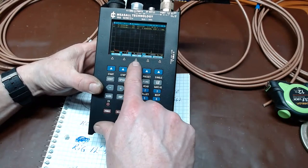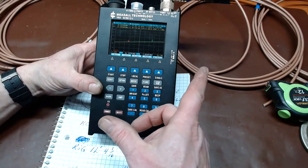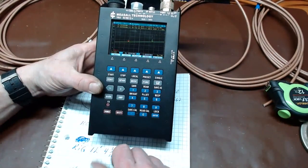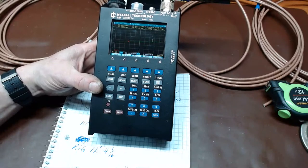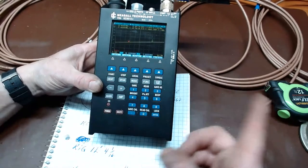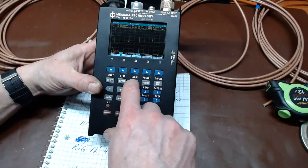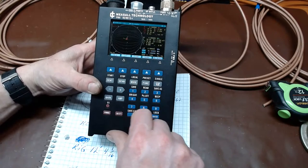So format, let's go over here to impedance, since that's what we were setting everything up to. Now you're going to see here on the same frequency an X factor of 1.6. So again, you've got to look at what meters you're using. Essentially what I'm trying to get at across the board is not every meter is going to be exactly the same. However, there are different attributes that, depending on how it reads, are going to give you the same information, and different layouts based on where you go. Let's see here. Smith chart. Let's look at this one on the Smith chart.